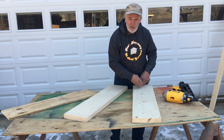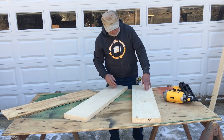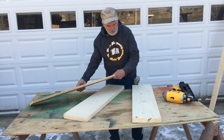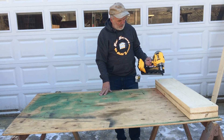This is the two-by-ten. We add three inches to the length of the header because there's going to be a jack stud that comes up under the bottom of that. Use half-inch plywood. So we put the header together and we're going to nail that off.